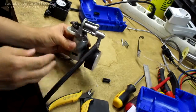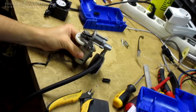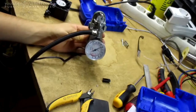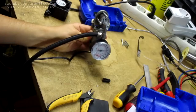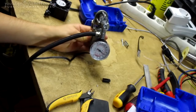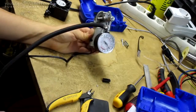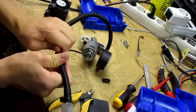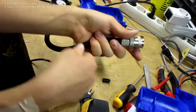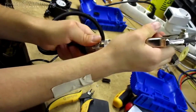Let's run it, if I can manage to hold it in my hand. You can see the pressure going up insanely high — we have 10 bars right in the middle of the scale. It just shoots past that now to 11 bars, or about 160 psi. That's because this connector just doesn't release the air until it connects something. And if I feel this hose, there is a lot of pressure there — that is harder than a normal compressor hose.